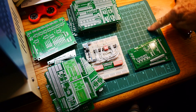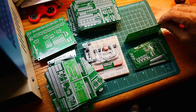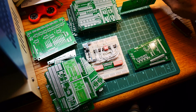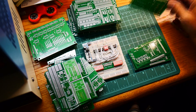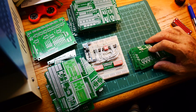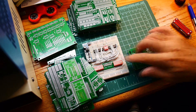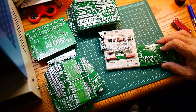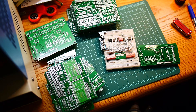Imagine that kind of design where you have a tiny little backplane, and the backplane is actually the data bus. Then you have your clock generation card, register card, RAM card, ROM card, ALU — and you could try different things out. I might have ALU1, ALU2, ALU3, just a more modular approach. And I don't have to mess with all these stupid little wires, which I really don't like. So that's the project, and I'll show you a little bit online and show you kind of what I've been up to and where I might be going.